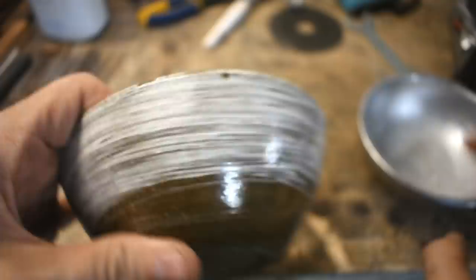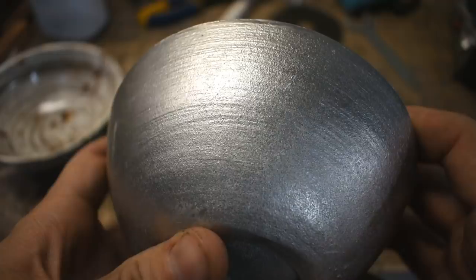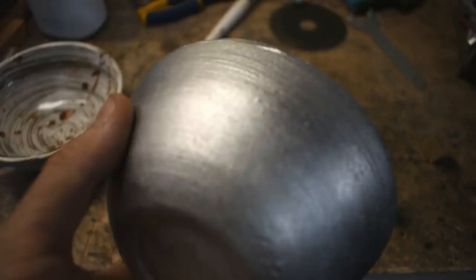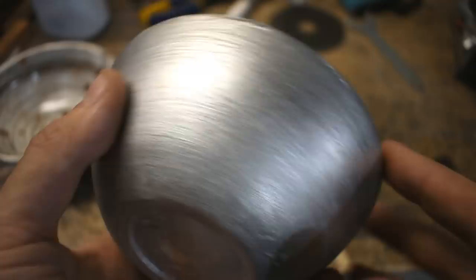I glazed this very thinly — only one layer I think. There are a couple little spots where there's a lump of glaze or slip that's a little thicker, and the brush marks came through in the aluminum. Super nice. Partly what got me this great surface finish is the gating system — the reverse gravity feed and the spin trap and all that. But also I tried something I've seen Myford Boy do, which is to coat the sand in talc. It seemed in his test like you'd get a better surface finish, and I don't have a control group but this surface finish is really good.